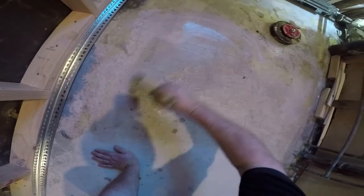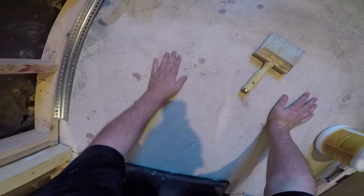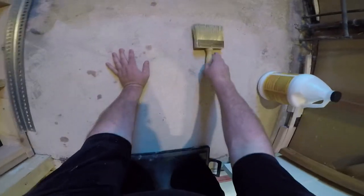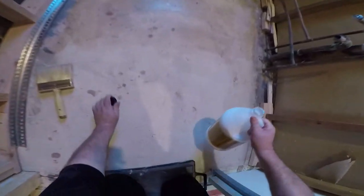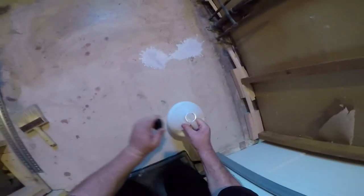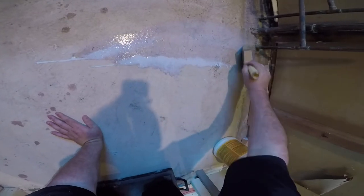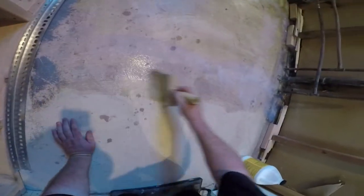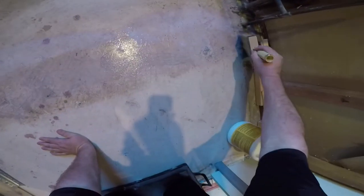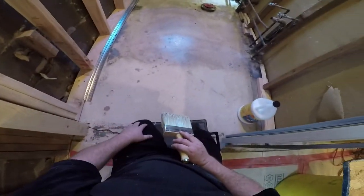See, you can get it done quick with a brush. You don't always need a roller, especially on a small floor like this in a bathroom. All right, so I can literally feel it right here start to go downhill. So I'm gonna stop right here because I may do something else up here. I have some self-level and epoxy I need to get rid of. I may go over this all with that. See what happens, because this floor is real bad. So I'm hoping to stop around here with the Sika self-level, then I'll feather up here with the epoxy.